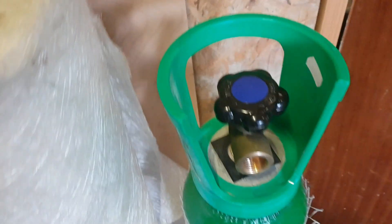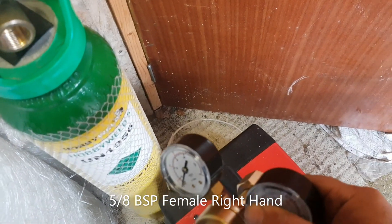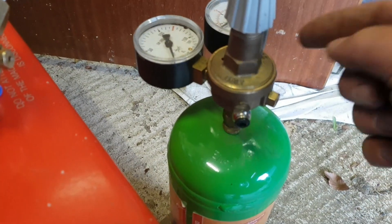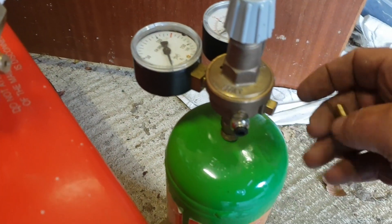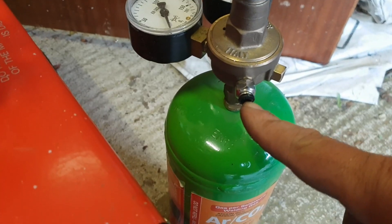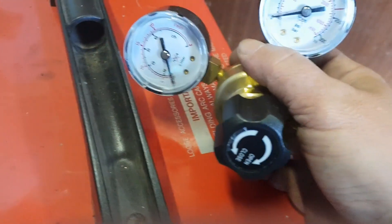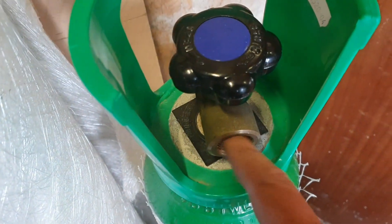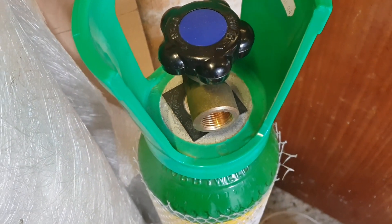You'll see over there it's got a female connection for an argon regulator, and these cheap Chinese ones are for CO2. So let's start with the existing regulator - here we've got the small bottle regulator which comes with most MIG welders, with the typical tube connection. And over here we've got the carbon dioxide CO2 regulator with a male connection. The HobbyWeld 5, being predominantly argon, comes with the female connection, so there are a couple of things we need to change.